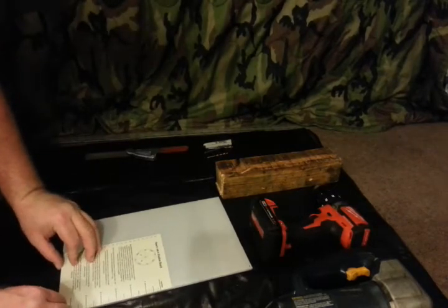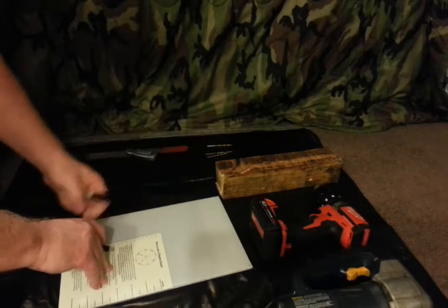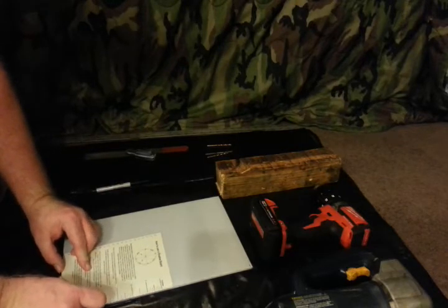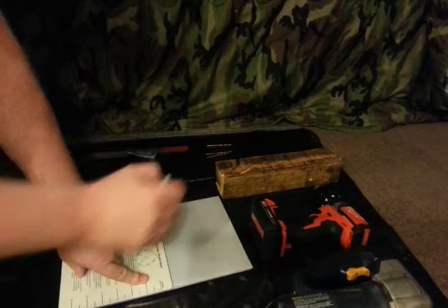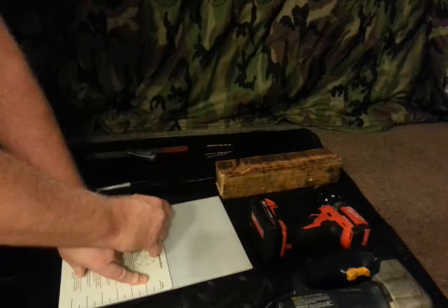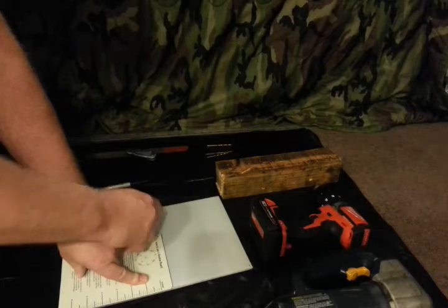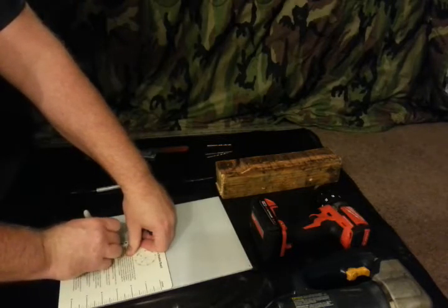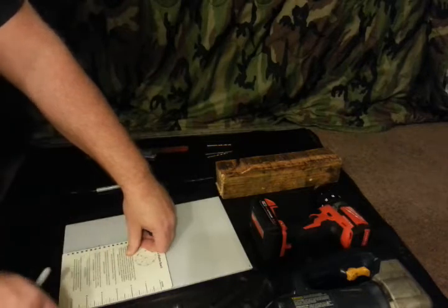And you'll only have to make two cuts using a squared edge. See, I'm squared up at the bottom, squared up here. Just take a marker. Make sure you're square. Just like that. And mark your edge all the way around. And then while you've got it here and you're still holding it, go ahead and mark all your holes. And then what you've got is your template.